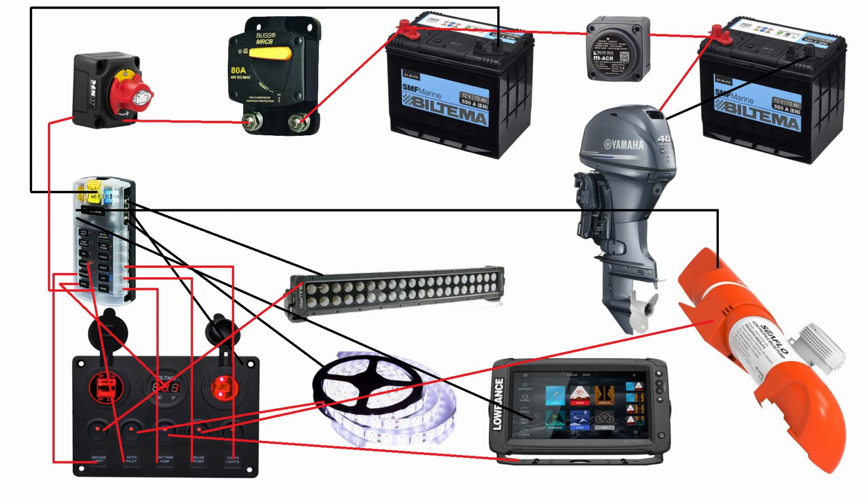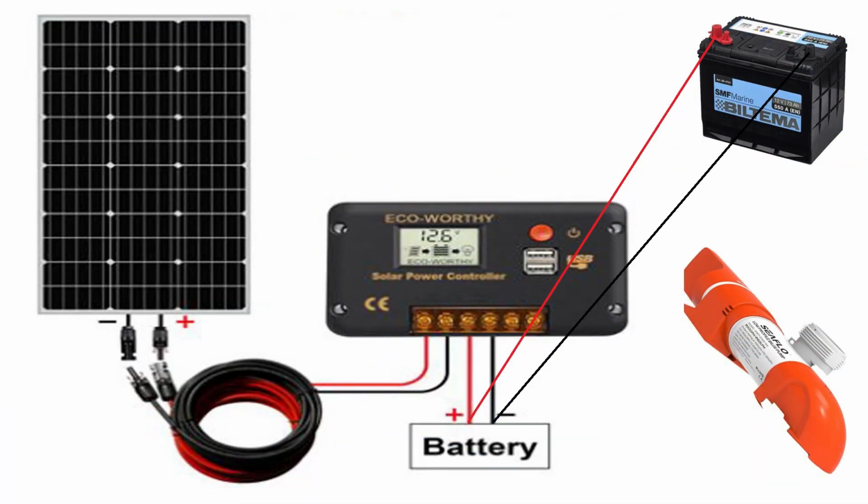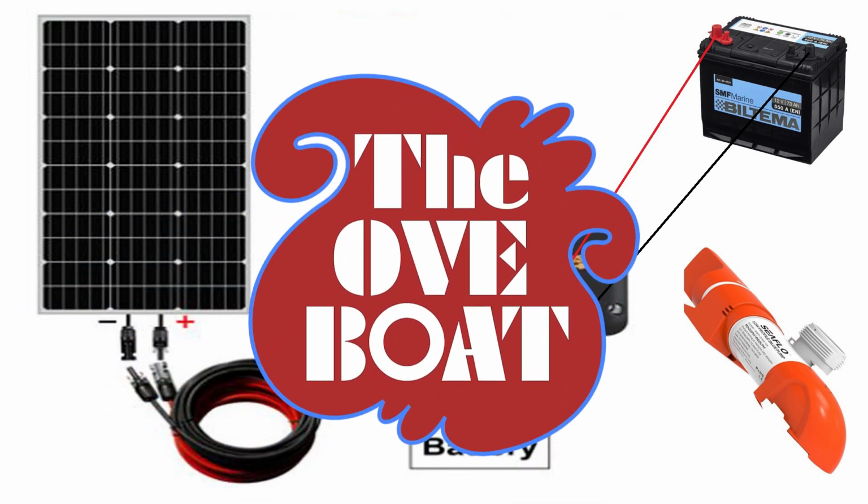This is the setup that I will be having in the boat eventually, but for the start, for building this electrical setup, I will only be using 1 battery, and once the time comes for the boat to be operational again, I will move to that 2 battery setup. One final addition down the road is that I will be buying a solar panel, which will be connected directly to the starter battery, and it will be used for topping up the starter battery, and in turn the starter battery will be topping up the home battery. But this will come at a later stage when the budget permits that.